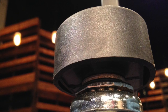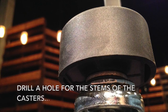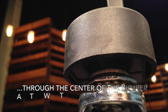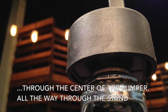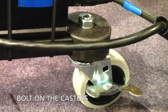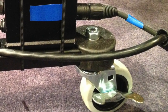After I got that material off, I put the rubber bumper back on the end of the feet of the stand, then drilled through both the rubber bumper and the stand — drilling from the bottom where the hole was for the little rivet. I made sure I had a hole the right size for the stem of the caster to go through — I think it was 5/16ths if I remember. Then I simply bolted on the wheel. It was really simple. I snugged it down as tight as I could without bending the metal of the feet of the stand, got it nice and snug, and it worked out really well.